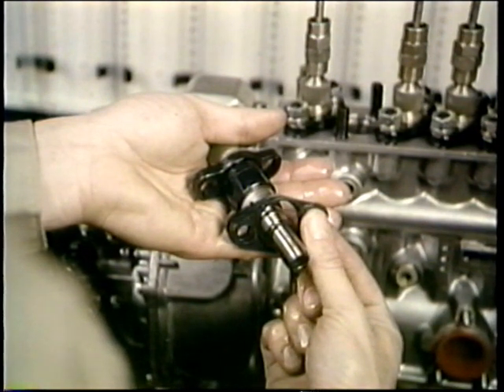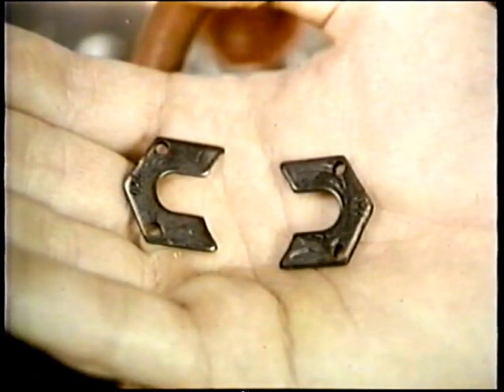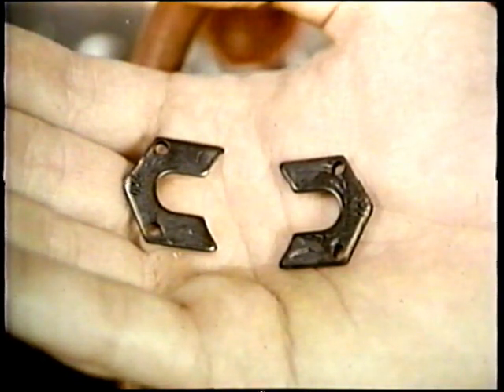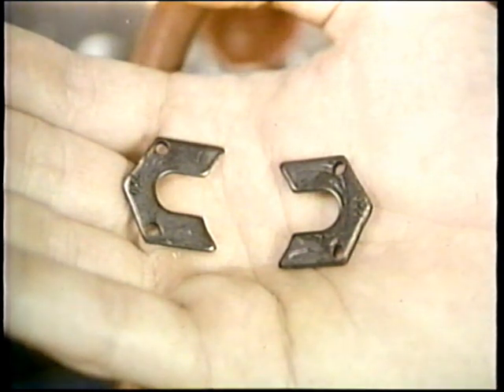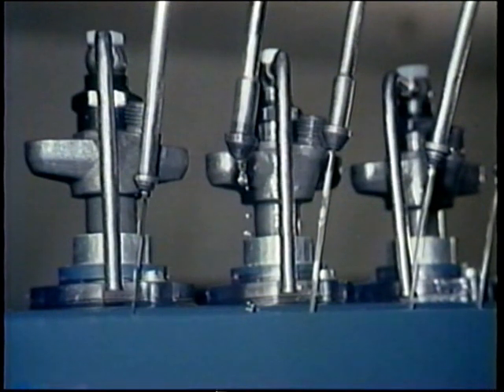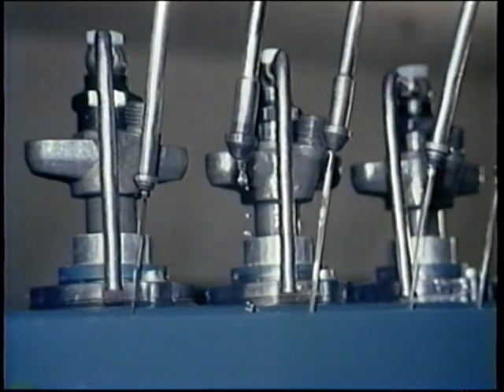You may remove the barrel to change a shim stack like this. Or with split shims like these, you need only loosen the barrel. Be sure both shims are the same size, or you'll cock the barrel in the housing. Smart technicians mic the shims going in to be sure port closure will show up on spec. When you've checked the last element — number four here — you've completed phasing and timing.